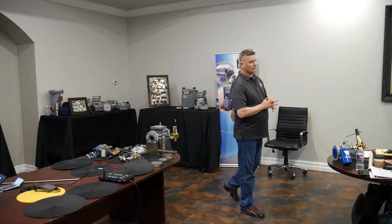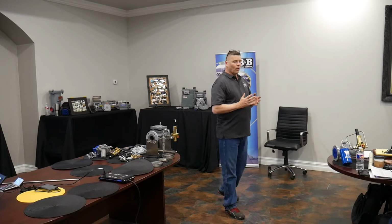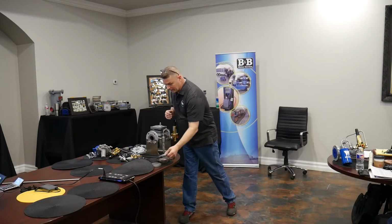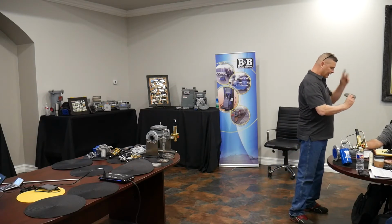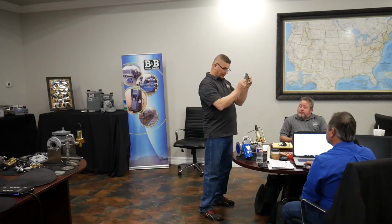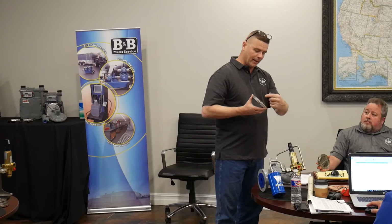Other advantages of the step drill hole plate versus a standard plate. Okay, excellent. So we talked about this turn down issue. You can see this live and in color. Typically if you're going to reduce capacity, and this one is a 75% slotted plate, I'm going to reduce the capacity by 25%. The way it happens with a slotted plate is they start with a 100% plate and they weld in restrictions at certain specific points. So the downstream side still has, when that diaphragm peels away, some places where it's blocked, but most of it, as soon as that peels away to that point, it's pretty open about as far down as the gas can reach.